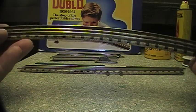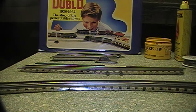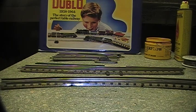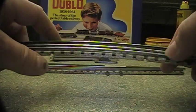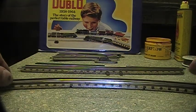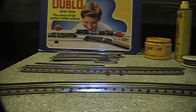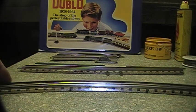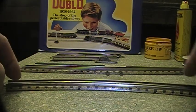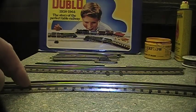And you need to inspect it. First of all, you need to check maybe for flatness. You can see when I lay this down on my work table, it's not very good. So if you just tend to work it a little bit, you twist it, bend it, you have to spend maybe a little bit of time on it, but already you can see it's getting better. The screws will pull down the last mil or two.